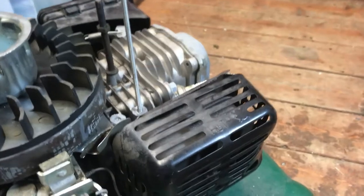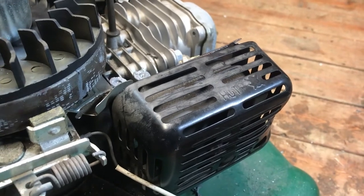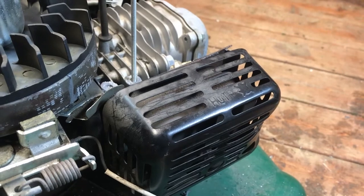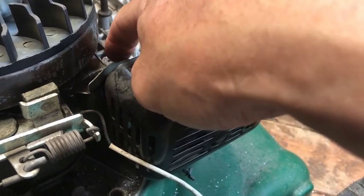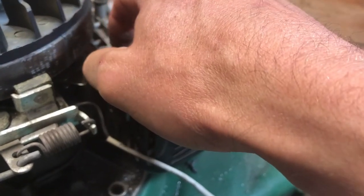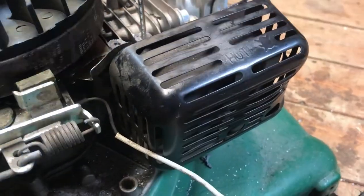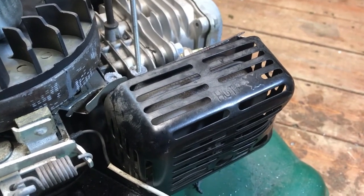This is phase one — I've drilled a hole and with a tap I created a thread here. I'm going to get a section of threaded rod to go in here and just need it to protrude a bit. I need to measure this and then do the same on the other one, which is going to be more complicated because it's very much against the engine — so I'll have to sink the threaded rod. But if I've got a bit of thread in each one, that's going to make these little towers much harder to move.